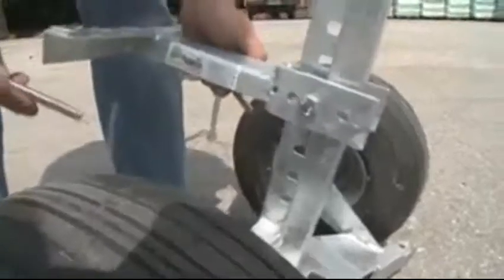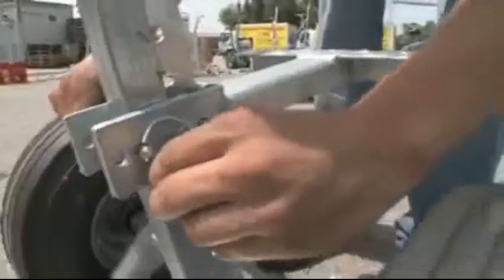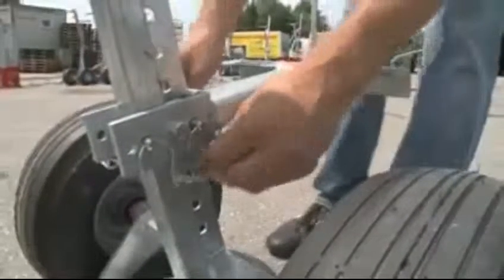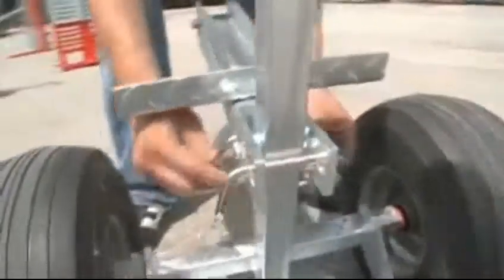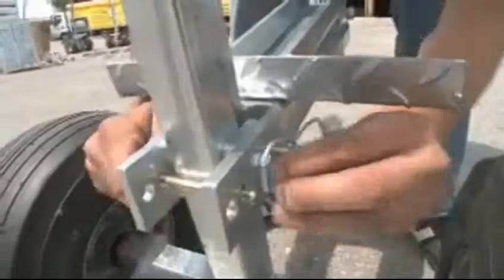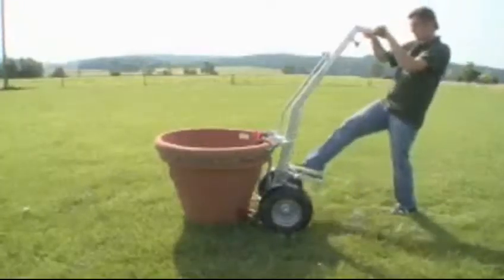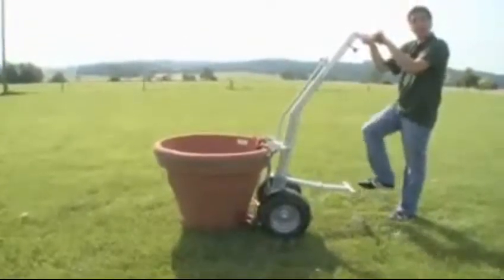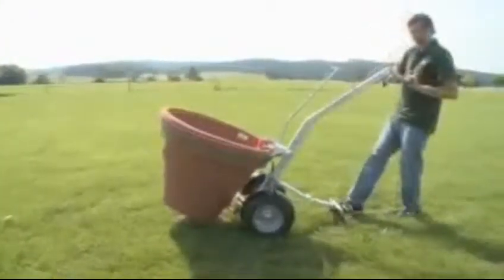The pedal is available in a standard and a foldable design. It must be attached to the lower part of the transport cart using 2 pins and a safety hook. 2 pins are generally required for the pedal, since the leverage may result in tremendous forces. When using a foldable pedal, it may be folded out in advance if required by the lifted weight, and must be folded in again with the foot for transport.